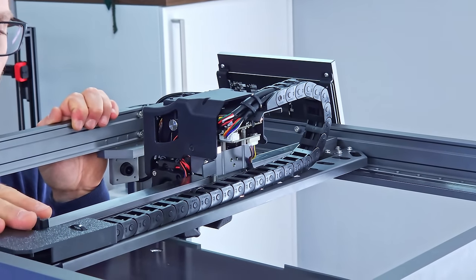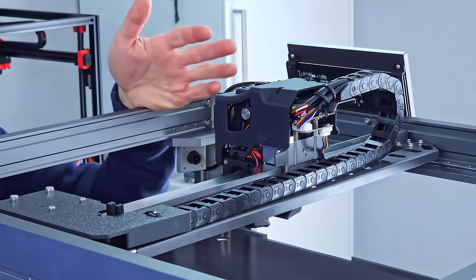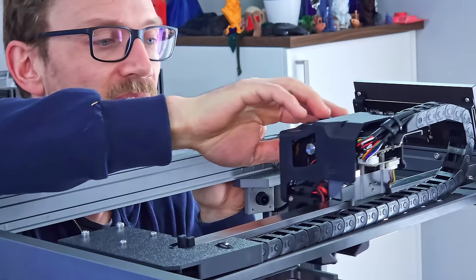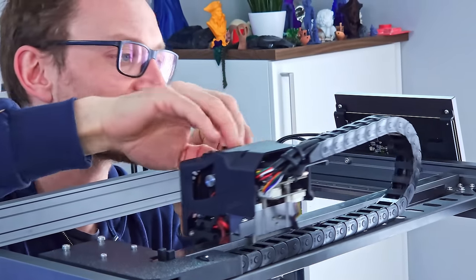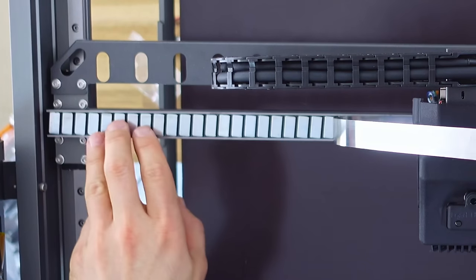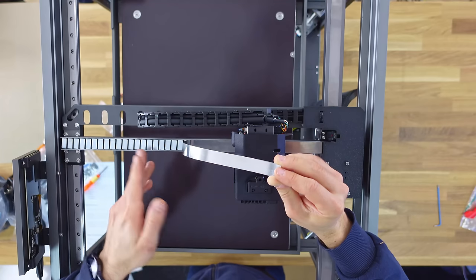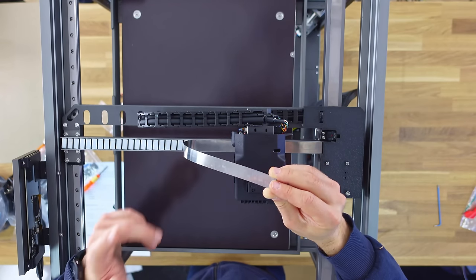Right, so on this entire motion system, you will have noticed that there are no motors and belts. That's the entire point of this thing. On the website, you can actually see the magnets stacked up underneath this shield. This literally, I think, is just a steel strip that has the magnetism going through it. There we go. Oh, wow. So this essentially is one step, if you want to say. Each of these magnets are flipped in the opposite direction. So one has north facing up, the other one has north facing down and south up.